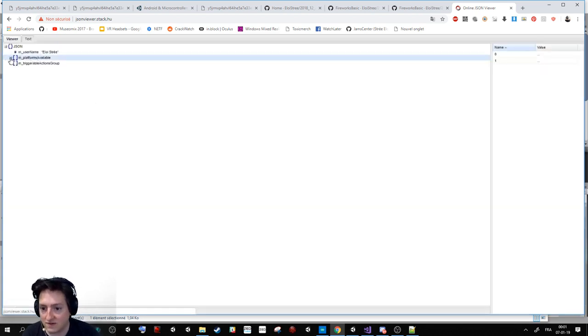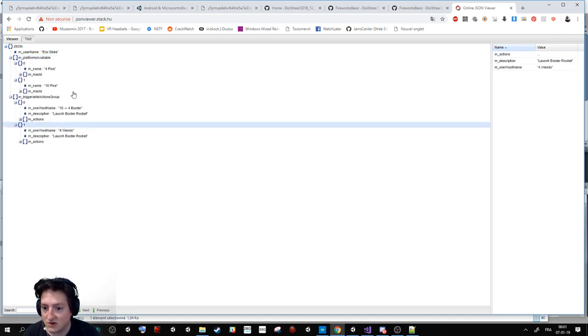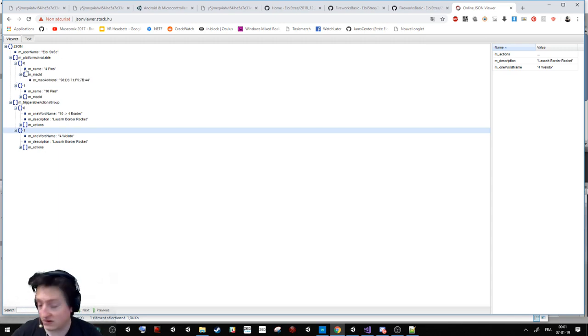So basically we have a script that is just storing some information, and that information is, okay, what is the ID of this device? It means the thing that allows me to communicate with it. Okay, there is a big problem with this device: you can ask it to connect by name and password, but you can also connect by MAC address. The problem is that I did not find a password for the MAC address, so I can connect to anything just by asking. Super dangerous, but here for the prototype I was not caring about it.